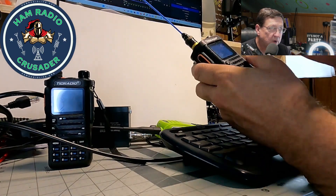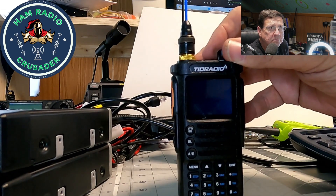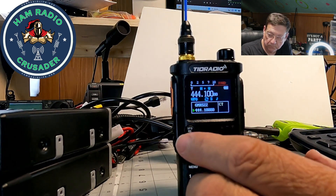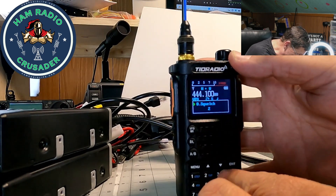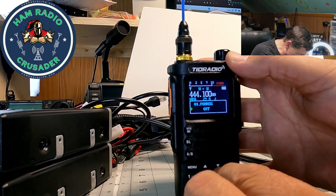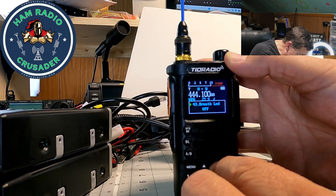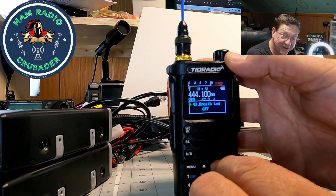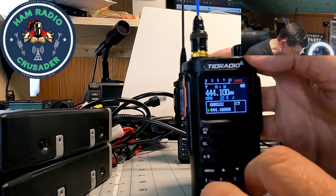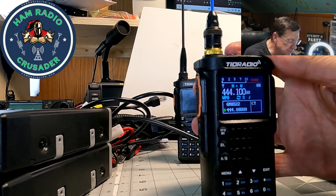I always like to do this before anything else — turn it off, then turn it back on. Let's see what we got. Hit menu, go down — there's our mic gain. Power on message. I'll hit menu and send it to icon, hit menu again, down — breath LED — and then there's the version: GMRS underscore 230830. Hit exit, power it off, power it back on, and there's our new splash screen icon.